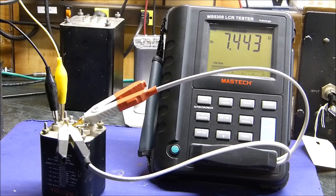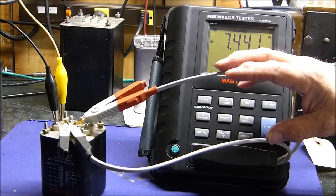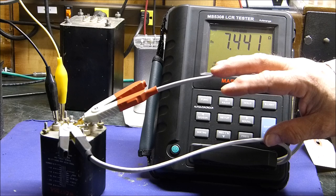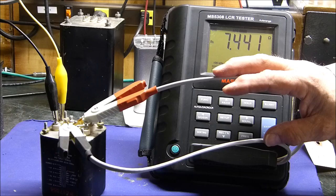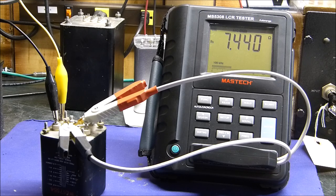What kind of conclusions do we draw from that? Is it because it's a small transformer? Its high frequency response seems exceptionally good. Its low frequency response seems to not be so good. But then that is not taxing the core. The output of this is about a volt, I believe. That was a question that was asked: what is the difference between the measurements I'm making with this one and the General Radio ZY bridge? This one's about a volt, if I remember correctly, because there are a number of videos made on this little device right here. The General Radio device, I was driving at plus 10 dBm uncalibrated, so it's a little higher now, probably about 4 or 5 volts. In either case, it is extremely small amounts of magnetizing voltage applied to the core of the transformer.